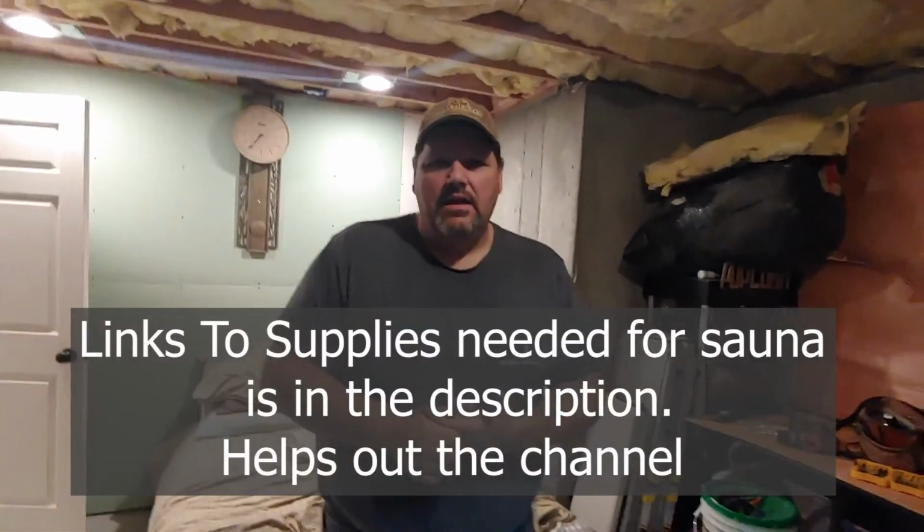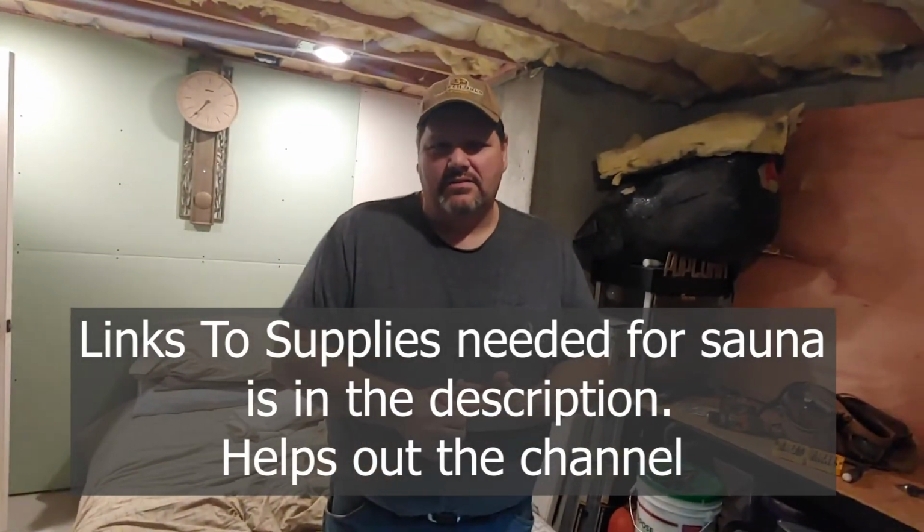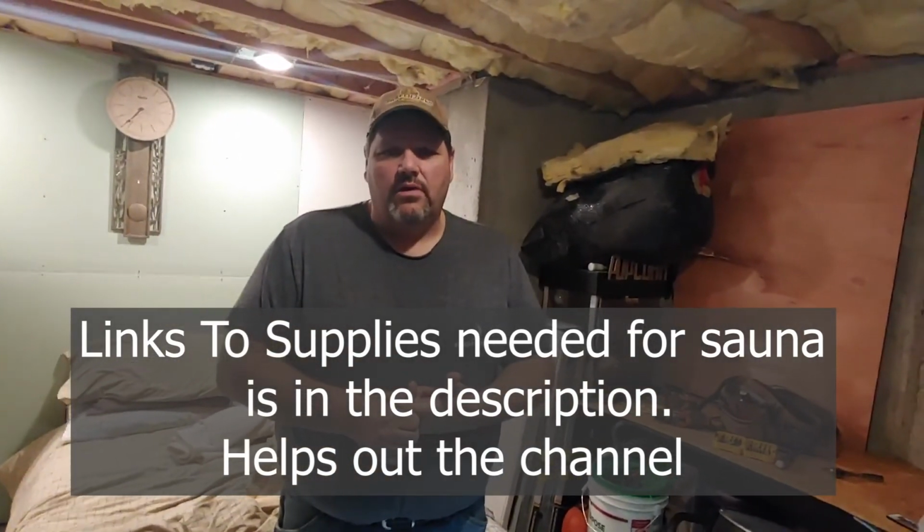Time frame was included in making the videos. Once it was unpacked, we had about an hour and 20 minutes. So it goes together pretty fast. I'm going to say about 10 minutes running the breaker and a box, but we're only 2 foot from our power box, so who cares about that? We were fortunate on that. We just had to get a 20 amp outlet, a box, and some 12-2 wire and a 20 amp breaker.